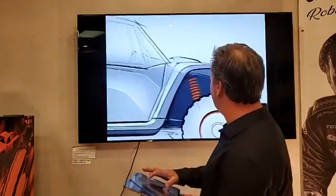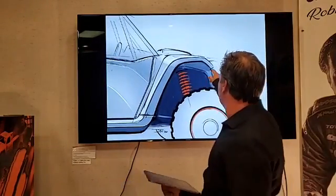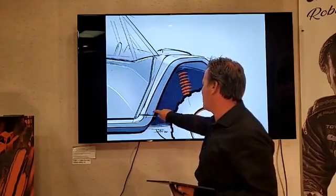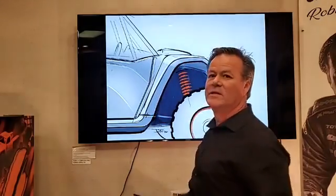35-inch tires, how much adjustment? Any body trimming? Okay, so the question was 35-inch tall tires, any body trimming? In the rear of the car, there will be no body trimming. So in the rear, plan on the 35-inch tall tire clearing the body. In the front, we will be doing a little bit of tire clearance trimming right here. We'll have to clean about an inch off of this throughout this. We'll give you a template to cut for a 35-inch tall tire.